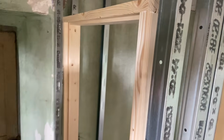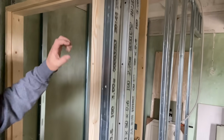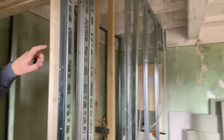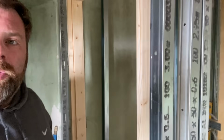So it's not far over, but it's far over enough to make the sink not stick out that far. I think it's gonna look quite nice actually. It's very simple. I mean, literally four screws and a bit of wood glue, and it's done. So hopefully it looks good, but it's certainly traditional. It's very clever the way they've done it. Everything is reversible. You can turn each piece upside down, and then you can turn the whole door upside down so that it can be in any position. What we need is the three hinges in there, and I'll put them on as soon as we've got this fixed up to both sides, and then we can put the hinges in and hang the door and make sure that it's straight.